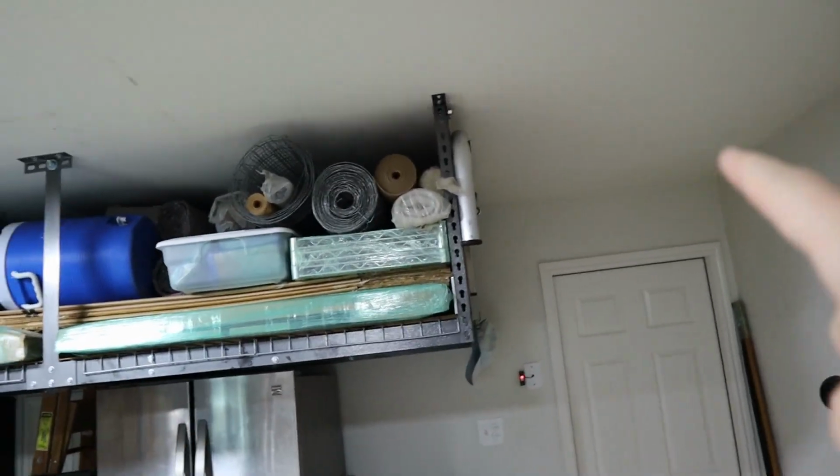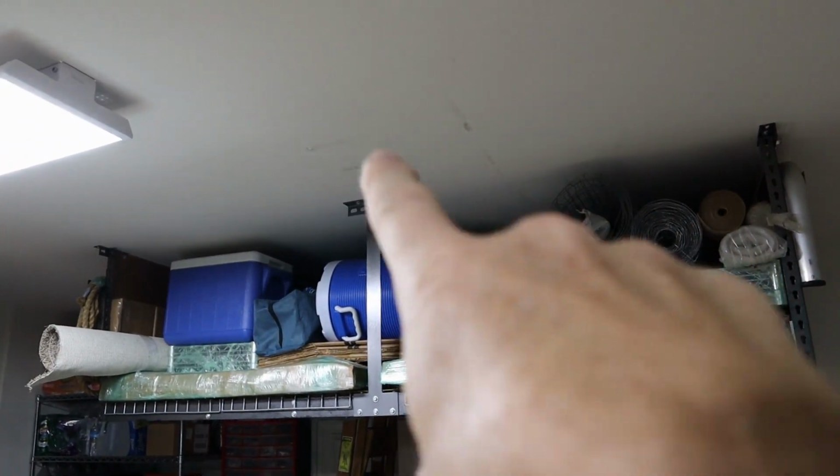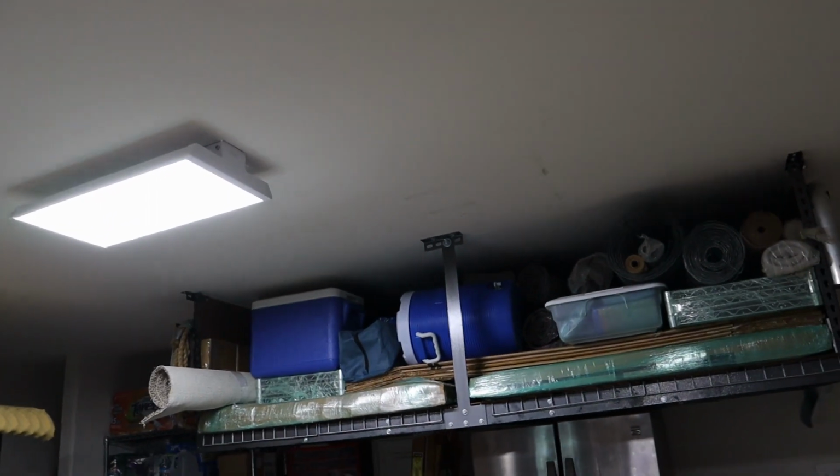And I measured from that line to the ceiling in that corner, at the back brace, this front brace, this center brace, that back center brace, that back brace over there, that front brace, in a line against that wall, at the garage door opener, a line across there, that corner, at that edge, and right here, and took all those measurements. And what I found is from the wall itself to the front of this shelf is out by an inch. The ceiling drops an inch, and most of it is right in this area here.